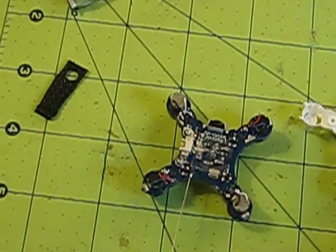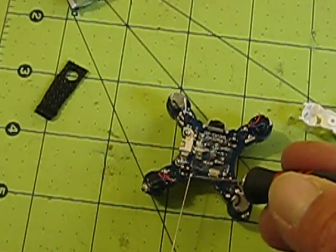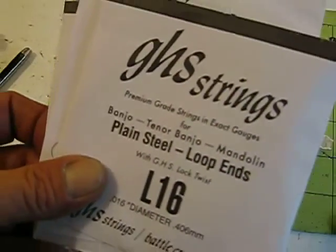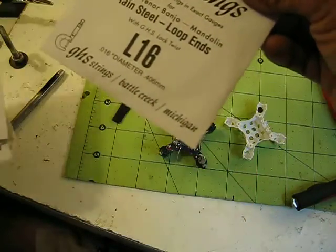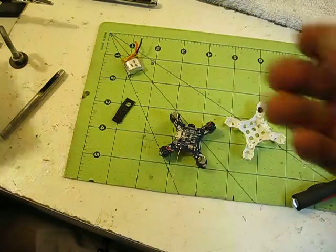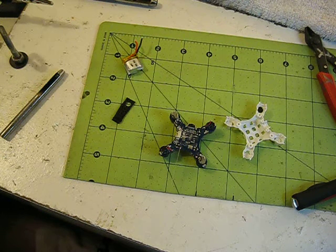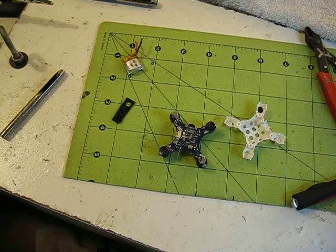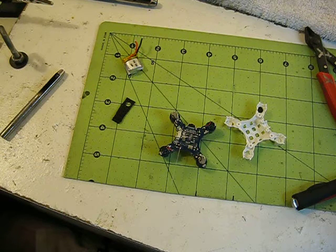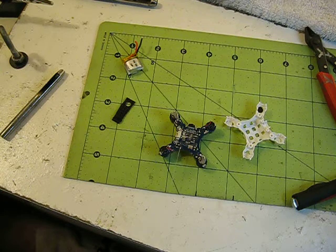So I scraped a little off, tinned the square section, then tinned the end of my wire. This is the banjo string wire that I'm using — it's stainless steel, and I used the .016 inch diameter. I like this string because guitar string is usually two wires, an inner wire and a wire wrapped around it, but these are just solid wires, so I didn't have to unwrap them. They work great, and the 16 thousandths inch seems to work good for this size.